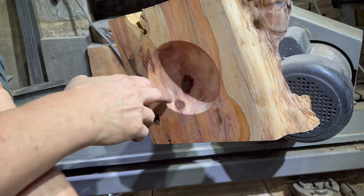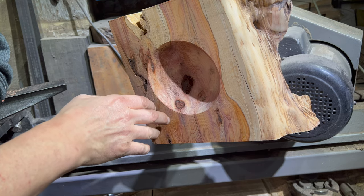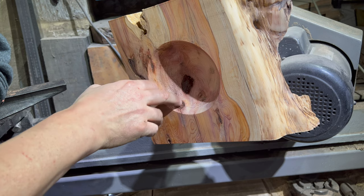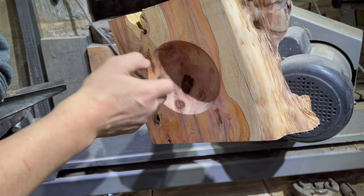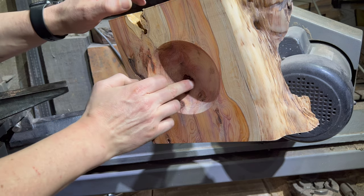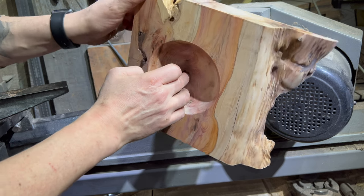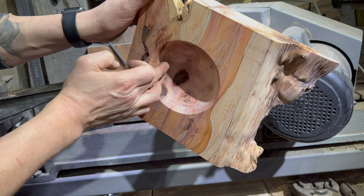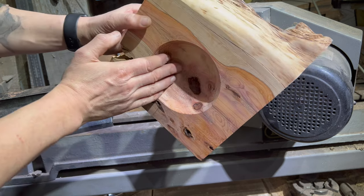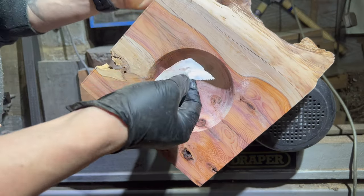I was having a little bit of an issue with the bowl gouges — this is quite soft. Before I start any sanding, I'm about ready to retire for the night, so I'm just going to shove a load of sander sealer onto these to help stabilize it a little bit. It's just a different consistency than the other wood — hence I was getting a bit of chisel skip as I came over this towards the centre. But otherwise the shape is very, very nice and tidy. Getting easy sand on that. Good depth to it, good shape — happy. It's only overnight because it's late.